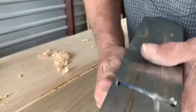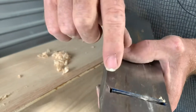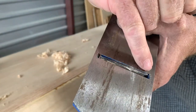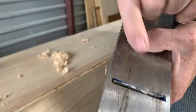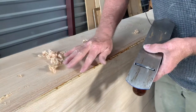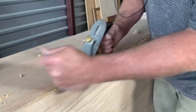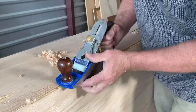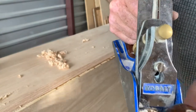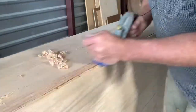On this one I made what I call a scrubbing plane — I curved this blade and angled the corner so it doesn't dig into the side. The blade is curved now so I can get into this area here without hitting my cabinet, and it just takes off shavings. You can see it came right off in the middle — that's where the deepest part of the curve of the blade is.